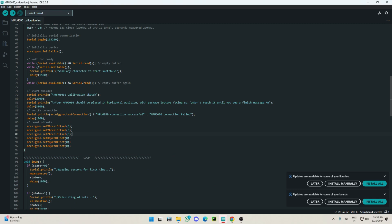Run the calibration code with the platform placed stably on flat ground for precise measurements. You'll get your offset values — these account for manufacturing errors and mounting imperfections since everyone's setup is a little different. You want to calibrate based on your final assembled system.